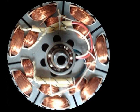These coils are fat and they're all wound in the same direction. The reason for that is there's only so much room for wire between the stator lobes, so they put all the windings on one coil instead of half on each of two different coils. If a machine wound it, it would have to wind all fourteen coils but change direction on each coil. This is one single wire on the outside until it gets around to the two wires that go down the middle of the tube and come out to where you connect. The other two sets of wires that come up that tube go to the inner set of coils.